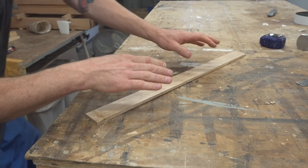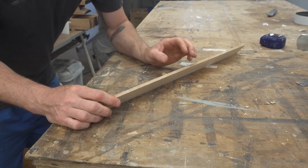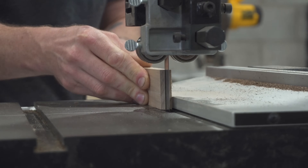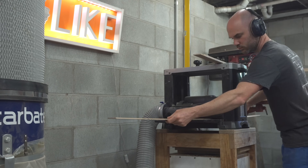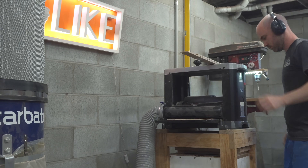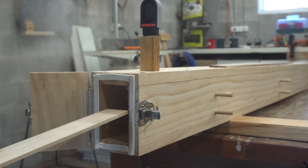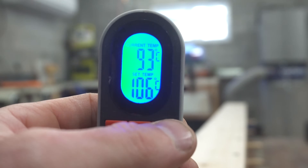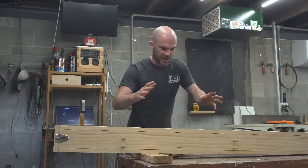It's day two. I've done a lot of research and think I've found some answers. The timber I've been using is Tasmanian Oak, which should be good for bending, but I think the thickness is where I'm falling down. This is six millimeter thickness, but rewatching videos I see people going down to four or even three millimeters with success. So I'm going to re-saw some down to around three or four millimeters and try again. I want to be more precise this time — getting it to a specific temperature, keeping it in for a certain amount of time — so I know the sweet spot for the actual project.